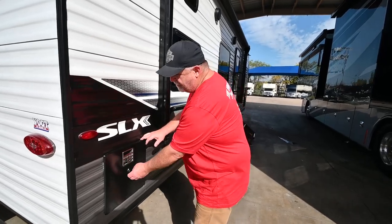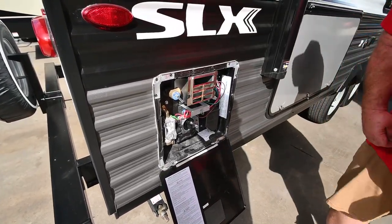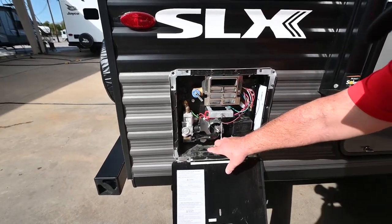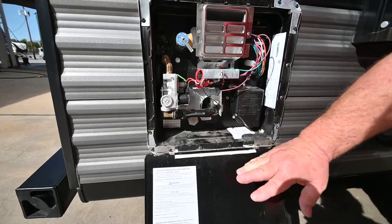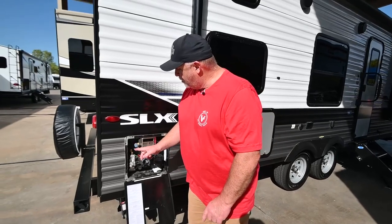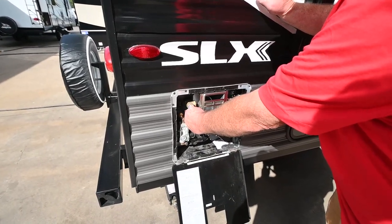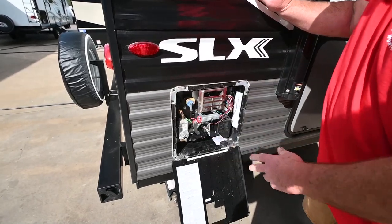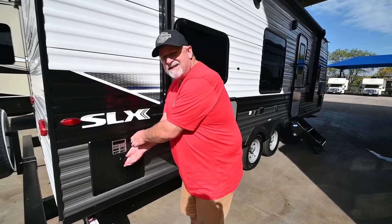This is the back of your water heater, which runs on propane or electric — that's selected from inside, which I'll show you shortly. For draining: this little white cap, when pulled off, drains all the water out of the water heater. I'd also empty it if the unit is going to sit for a month or more, especially in summer, so the water doesn't get stagnant and moldy. Before you pull that white cap, release the pressure using this pressure release valve — just pull on it and let the water out until it stops. If you forget, that plug will shoot out and soak you.